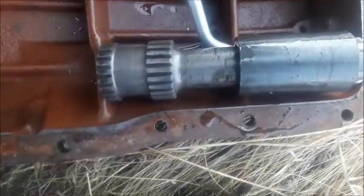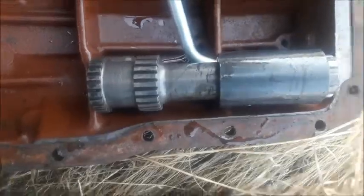I just pulled the rear drive shaft out and the coupling. Just like Rachel Grindahl says in her video — you push this fork into low, separate the coupling back at the cotter pin, push the coupling forward, pull the shaft out, and it tips right out. Now I'm right here at the pump, so I'm probably going to have to drain some more of this oil to continue.